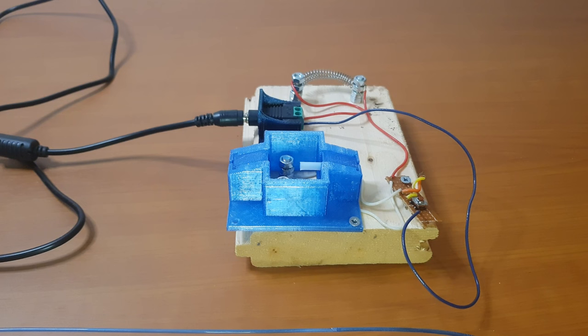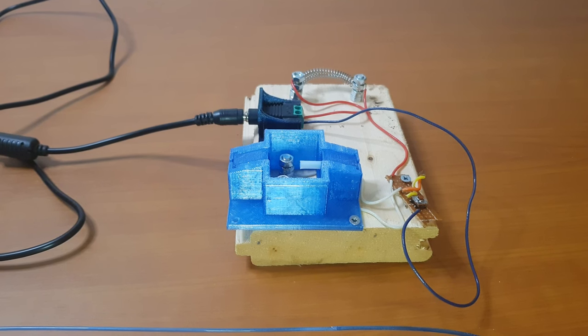In a few final words, although this method is perfectly usable, PET filament does not weld easily, so expect some failures from time to time. Using this method, you have a great deal of control because the filament does not light on fire. It's easy to move it around while it's melted and then do the weld, but still it's not always perfect.